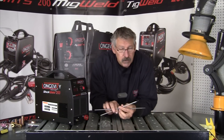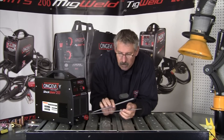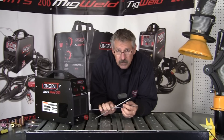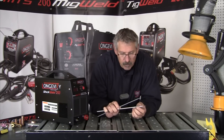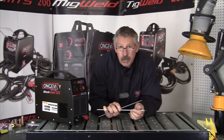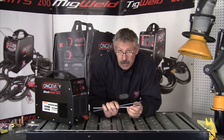Steels are manufactured to chemical compositions — an A514 is a different combination of materials than an A36. When you start to alloy steels with nickel, copper, chrome, or moly, you're after a mechanical composition, and the standard chemical specs no longer apply because you're seeking a mechanical advantage — either strength or corrosive properties. When you see a two-letter designation at the end of the AWS numbers, that indicates an alloy rod. A1 is a carbon-moly rod; B1 is a half-percent chrome, half-percent moly rod; C1 is a 2.5% nickel carbon-nickel rod.